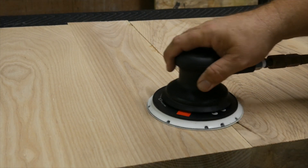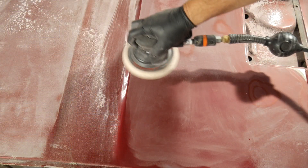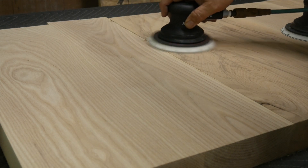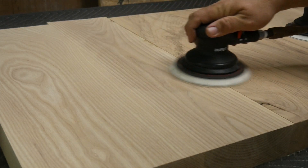That nine millimeter orbit is what you're going to use for the first rough cut, where you're taking off the majority of your material. That's where you're leveling out, easing the edges, doing all that work to get material off. For wood, if you're filling deep grain, you're knocking all that down with the nine millimeter — say 100 or 120 grit sandpaper.